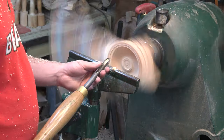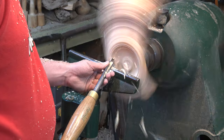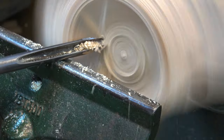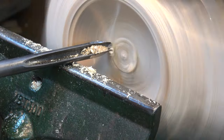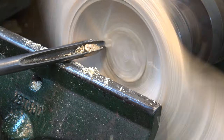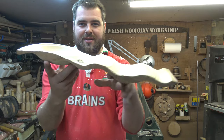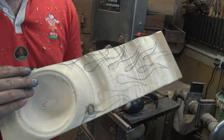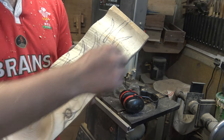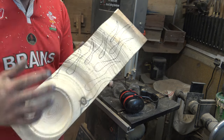I want to leave a little rim there so I can put a box lid on. As I'm getting towards the bottom of the box I can start blending in the bottom again with some push cuts. Ideally you want one smooth transition from the top of the rim all the way down to the bottom — that will leave you fewer transition points. So this is the profile then.